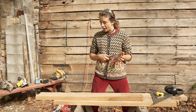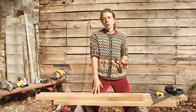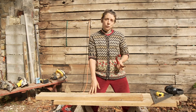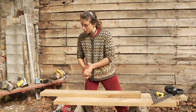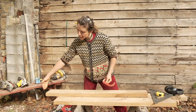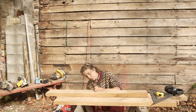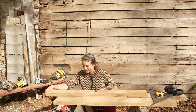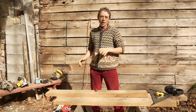I want to introduce this wonderful tool — the clamp. I find clamps really helpful, especially when you're working on your own, because the number one thing you want to ensure when cutting with a circular saw is that your piece of material is not moving around. I'm going to be taking small chunks off, so I'll let the material stick over the edge of my supported work table just as little as I have to in order to comfortably make the cut, and then I'm going to clamp it to my work table so that as I'm sawing, it's not moving around.